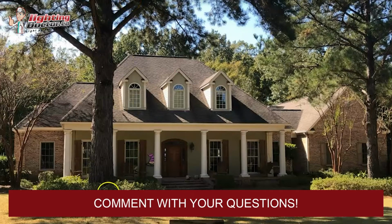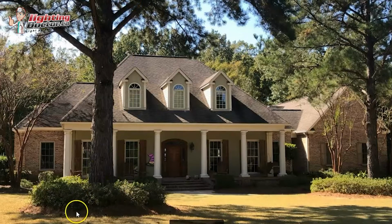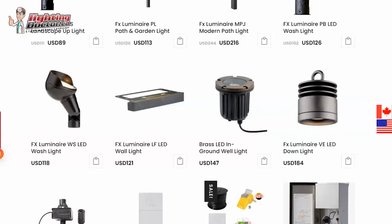Depending how thick this is around, you might have to put that light on a bit of a riser, so you can get a 6, a 12, probably like a 12-inch riser, so that uplight is just sticking up just above the shrubs here, so that light is getting past there. But if there's lots of room back here, or you trim it a fair bit, then just having 2 uplights would be a really good way to light that.